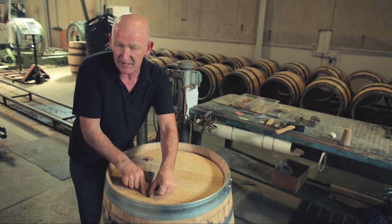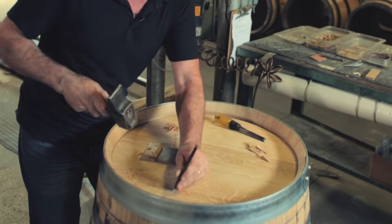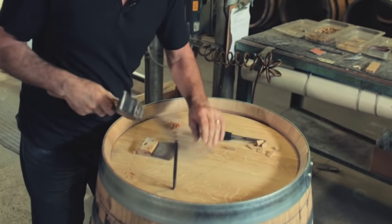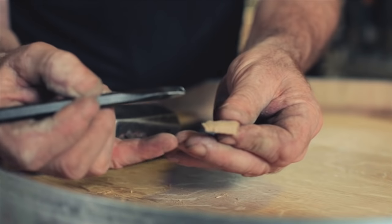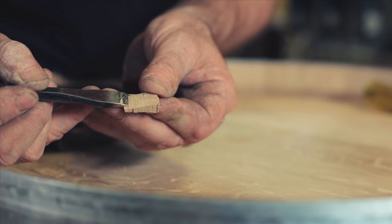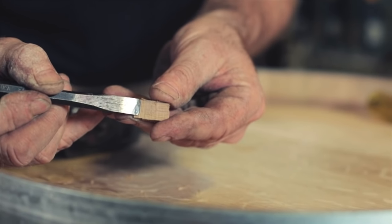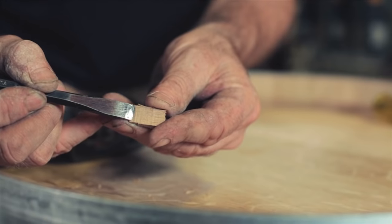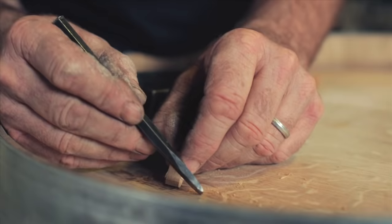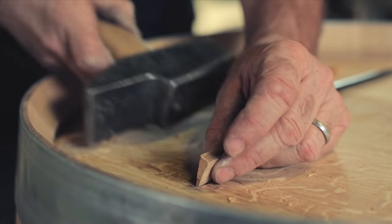I'm going to go just half an inch above the leak and use a small chisel here, going maybe half an inch in. Now I'm going to take out the chisel and check that my wooden wedge is slightly wider than the chisel. If it's the same width as the chisel, it would leak either side. So always slightly wider so that we have to force it into the hole that we've made. Always across the grain — never lengthways with the grain, or you would split the grain all the way up this head piece. So now I'm going to hammer the piece in here.